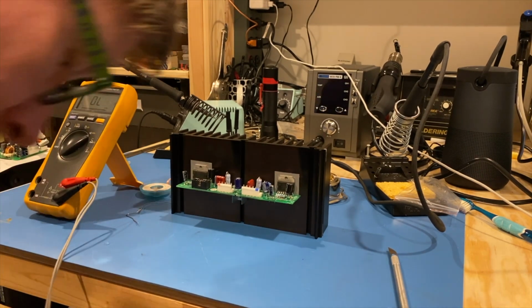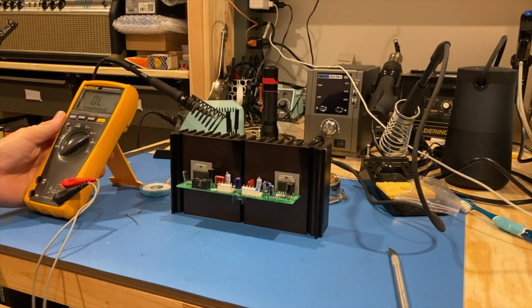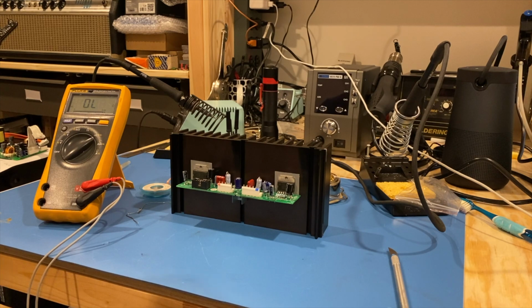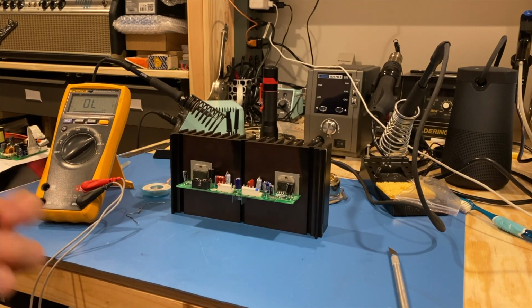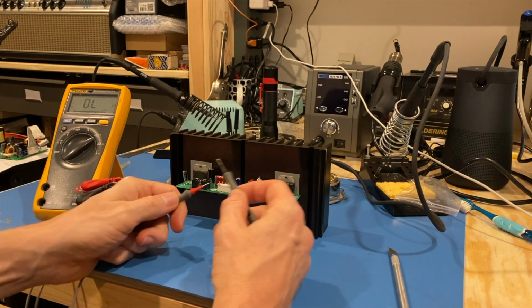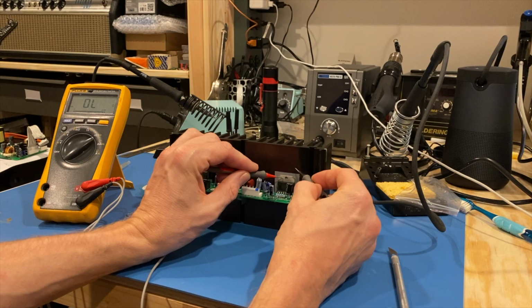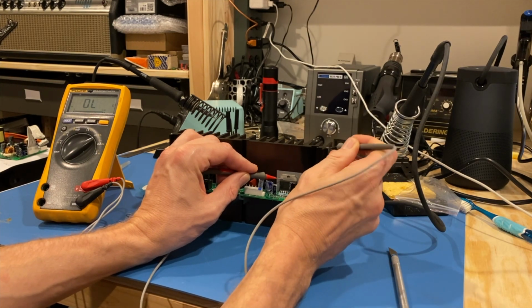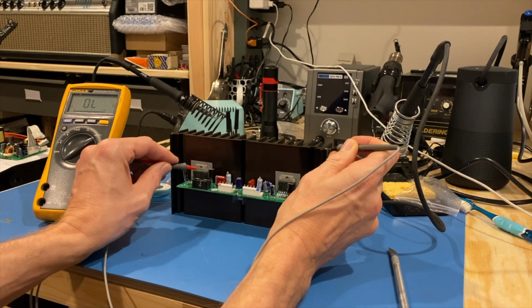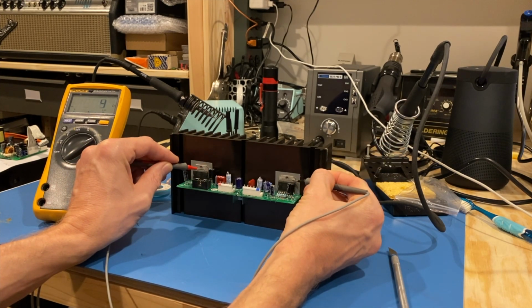So one important thing to notice on here is, if you guys are going to work on one of these, in certain circuits, the body of the TDA7293 is actually connected to ground, and sometimes it's not. So in this case, it's not. So I'll even go here on the non-black anodized. You can see that neither body is connected together.